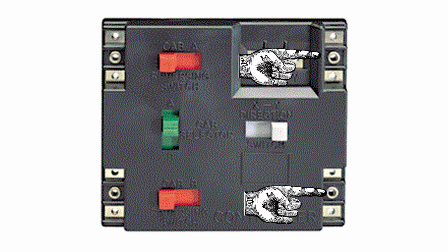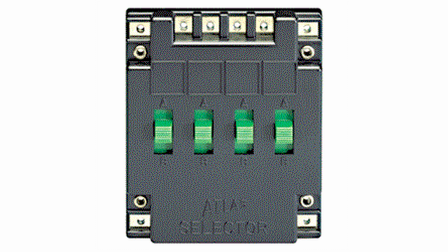Now the output of the controller are these two sets of connectors here, and you can connect directly to the track, but it's sort of ill-advised. What they want you to do is run the output of this through the 215 block selector. This consists of 4 single-pole double-throw switches with a center off position, and then you can connect all of your individual track blocks to these switches.